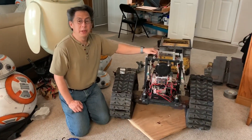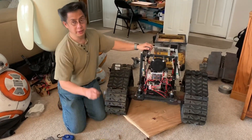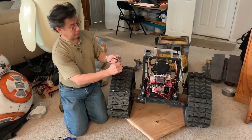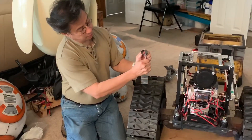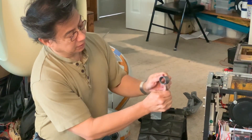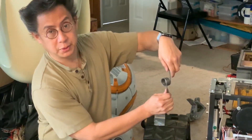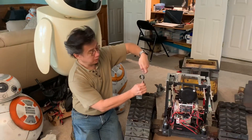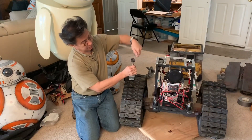Let's start with the arm mechanism and I'll show you how that works. In the arm mechanism we have a torsion spring, and I'll demonstrate this again as we move along. When the arm is at its lowest point the spring is going to be under tension. As the motor lifts, the spring is helping it lift, and then when it reaches a certain point there's no tension needed — that's when the arm is raised at its tallest point. So, down here to up.